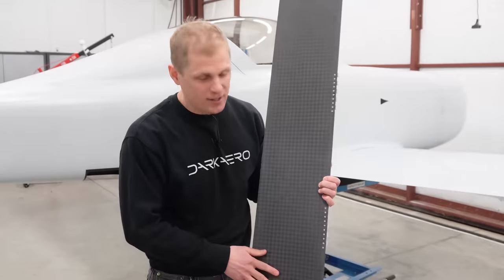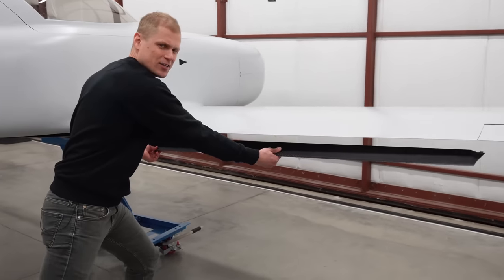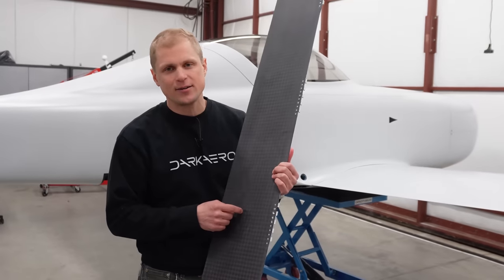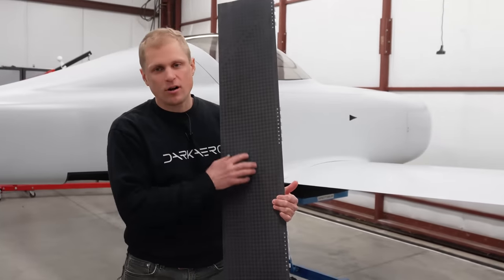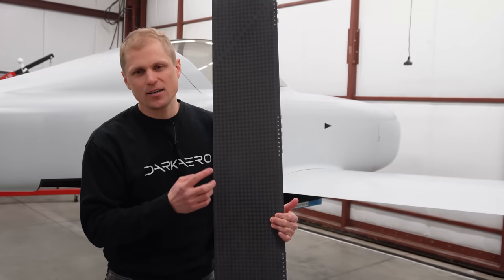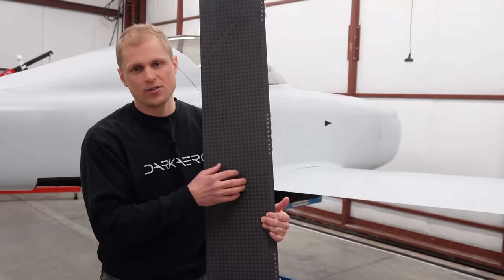Here are the results from the clear coating. The idea with the flaps is that they're on the bottom of the airframe, so they're not getting direct sun exposure. We have okay results, but we want to do some more testing. The other thing with clear coat is that it preserves the dark color of the surface, which could heat up in the sun. There's a little bit more testing we want to do to validate the upper temperature limits of this arrangement.